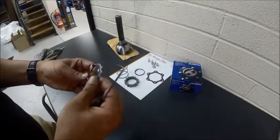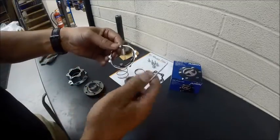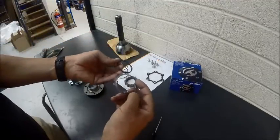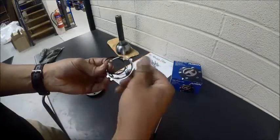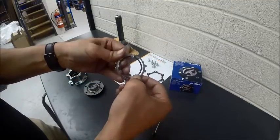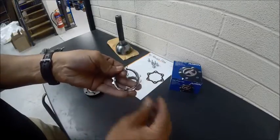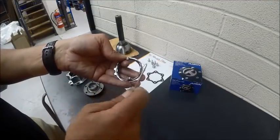Inspecting the steel tab: we have a couple of bent-over tabs at the top and bottom, and another two underneath. To assemble, grab the spring — you'll notice the spring has a little ear at the top. Put that at 12 o'clock. We're going to bring the spring inside of the tab, with this part of the spring up against the tab. The top coil of that spring must go over the top of those two tabs.